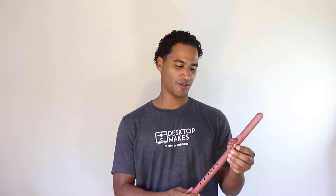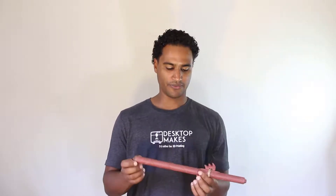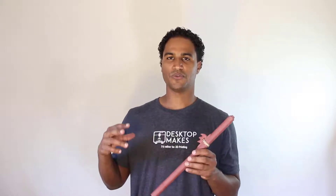The reason why I'm doing this video is to show you the technique on how I put this together and did a little bit of the post-processing, but also because I had to bring it into Fusion 360 to modify it. When I printed it I wanted it to print upright instead of flat, and it just wouldn't fit within my build envelope upright, so I brought it into Fusion and split it in a way that would allow me to easily assemble it again. Here's the video along with a few tips and tricks I came up with along the way.